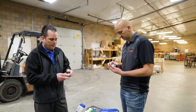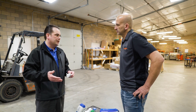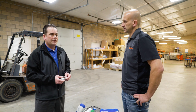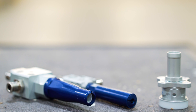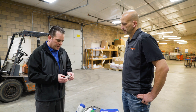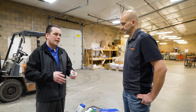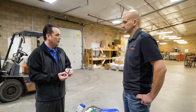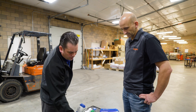What this is here is what we call our smallest composite gripper, the series SCG. It was designed for picking up textile materials — woven carbon fiber, textile bags, that kind of stuff. You give it a compressed air supply, this is actually the exhaust here, and it creates a massive amount of flow. It's low vacuum but high flow, so it's a unique gripper.